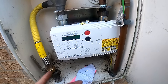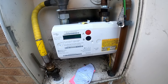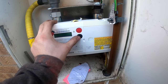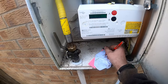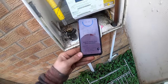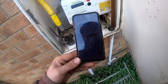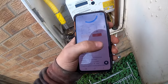Some smart meters do tell you the gas rate if you keep recycling through. We've got about another 15 seconds on this and then we'll hit the button again. That's gone to 113 — it's coming out exactly the same, within a percentage of a point. So yeah, do them however you want. Probably do them to one minute if that's what they're saying, but if you're doing them to two minutes it's not going to make that much difference.